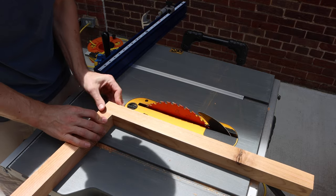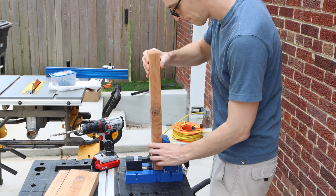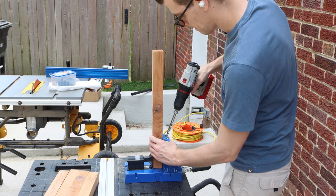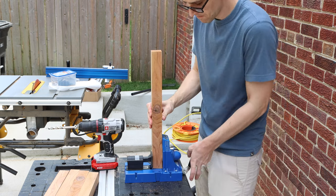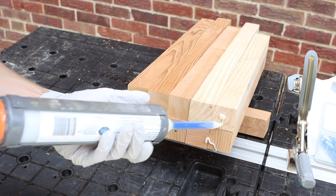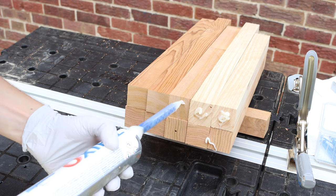It can be a bit confusing, but I got there in the end. Almost all the seat ribs — those vertical sections of the back and seat — are connected to the horizontal sections using pocket holes. Make sure you drill those face up since they're going to be covered by slats anyway. I used more epoxy and screwed them together.